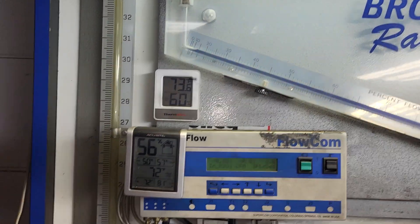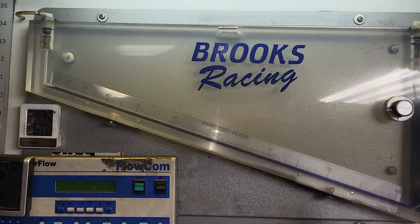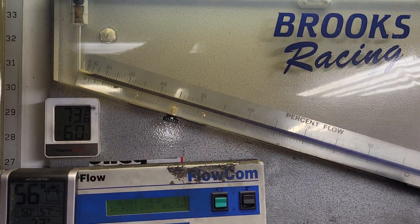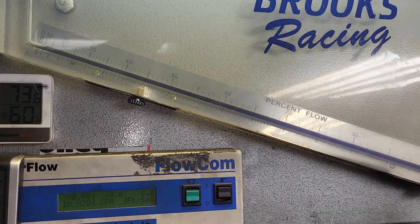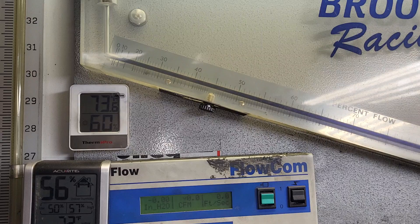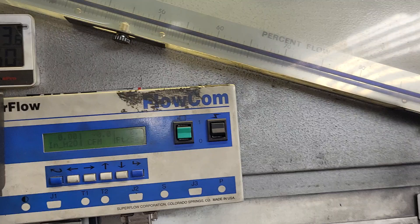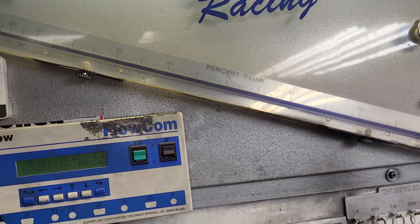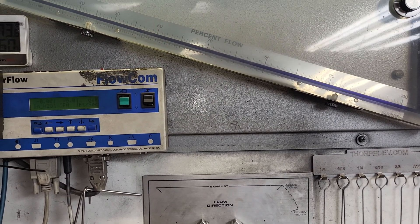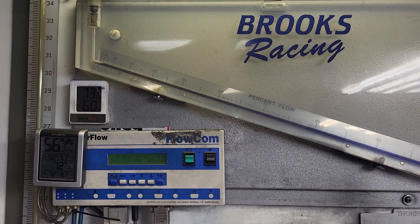This was an SF300 — you can tell because it only has one manometer. The SF600 came with two manometers. This one has been upgraded to 600 specs. In order to do that, it needs eight vacuum motors and a different motor controller behind the wall. It also needs different fluid in the manometers. The blue fluid and the red fluid you can get right from Dwyer — they'll hook you up with the right fluids, because the fluid used in the SF300 is different than what you need for the SF600.